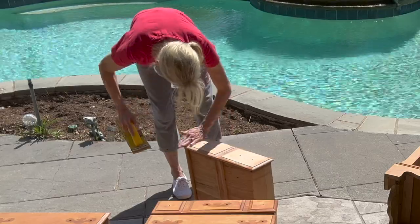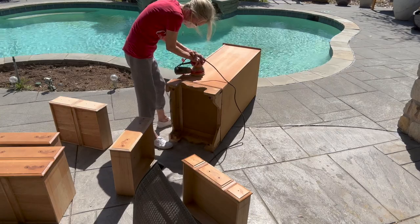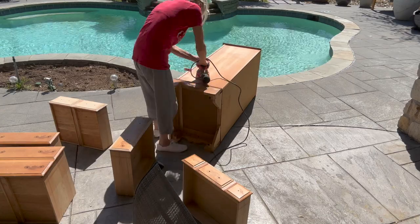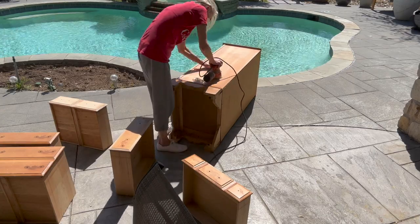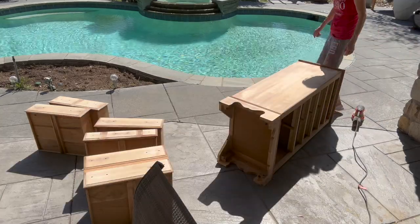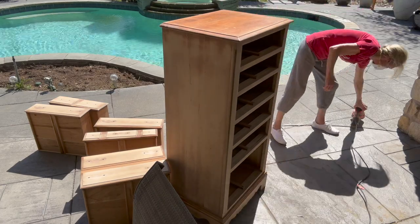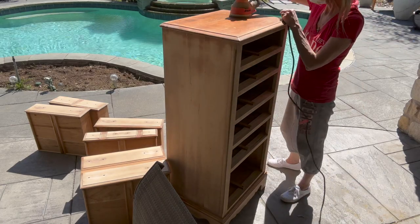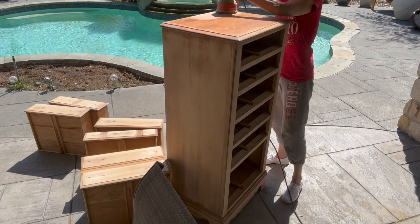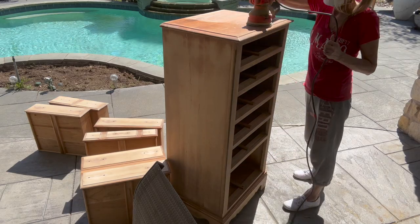I just went around the sides of the drawers a little bit to knock all the shininess off — just kind of prep it. With chalk paint you can actually skip this step if you know where the piece of furniture came from and it's been inside; you could just paint right over it. But since this was in a barn outside, I'm just making sure there's no moisture underneath. I'm not overly sanding it, just knocking off the shiny part. I did sand the entire top because I was going to stain it, but I changed my mind and painted it instead.